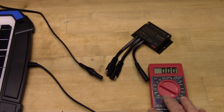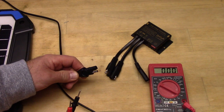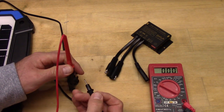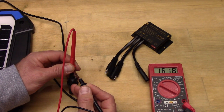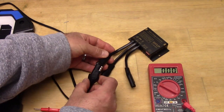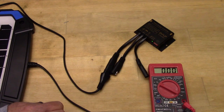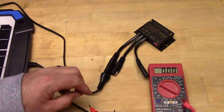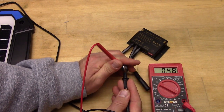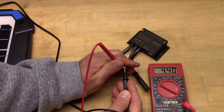I have a meter set up for 20 volts DC. This right here is the cable coming from the charger. We're going to plug the positive into the positive and touch off on the negative. So you can see it's doing about 16 volts. We're now going to plug it into the controller. I saw the green light come on the controller, and you can see the controller takes it down to about four and a half volts.